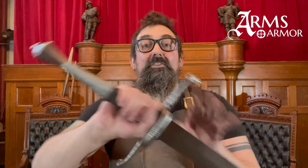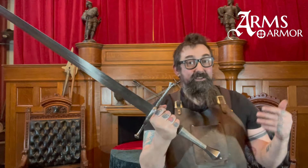We also have, as you can see here, a peening nut on the end with the peen. This is something we prefer to do on most of our pieces because swords shouldn't be completely disposable. If something goes wrong you should be able to fix it. It's one of the nice things for customers in the western hemisphere — having a swordsmith in the same hemisphere as you. If something happens to one of our swords, you can mail it back to us or bring it by and we'll put a new grip on it. That's one of the reasons we prefer this kind of construction — it's easier to take apart rather than grinding out a peen deep inside the pommel. That's one of the reasons they did it historically too.